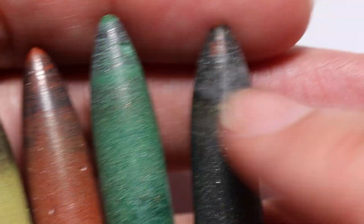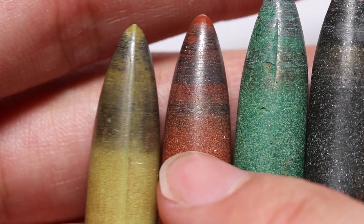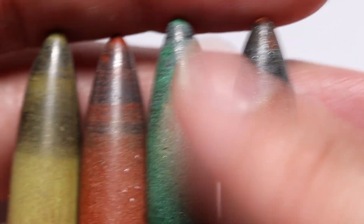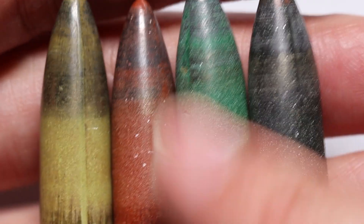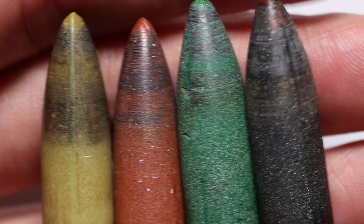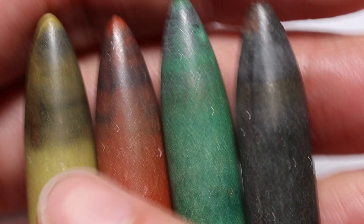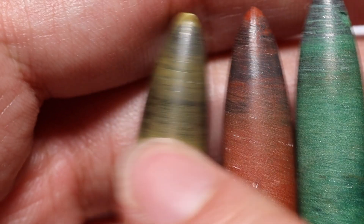It's probably good to show what happened to the burrs before I move on to the other metals. You can see here you've got a fair bit of the metal depositing on the surfaces, but the burrs themselves weren't really wearing down too much at all. You can see I worked brass - that's not gold, that's just brass - so it's getting that brassy color. Before using these on any stones, I'll refresh all of these with the aluminum oxide dressing stick just to peel all of that off, scrub it up nice and clean, and then go back to a fresh resin diamond face. I don't really want those little metal particles doing anything to the stones - it'll also deposit that metal on the surface and I'll get metallic smears, which is no good. So maybe I'll just set these ones aside and reserve them for my silversmithing stuff, though I think I would probably only use this one.